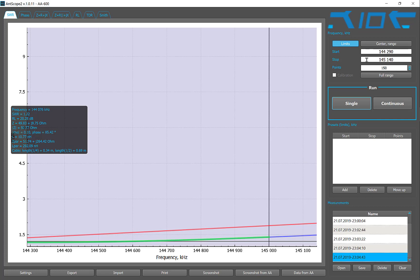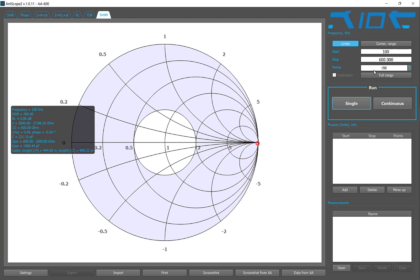Now I'm interested to see the Smith chart. Let's clear this and go from 143 megahertz to 148 megahertz. Let's run it. My understanding is that if the line crosses the zero line, it resonates at that particular impedance in ohms. Right here the ohms is at 61, which is very close to 50, and it's resonating at 144 megahertz — that's pretty neat.